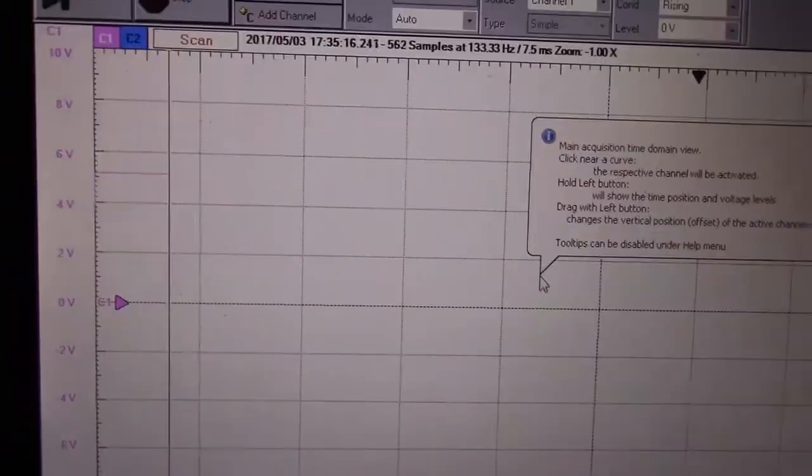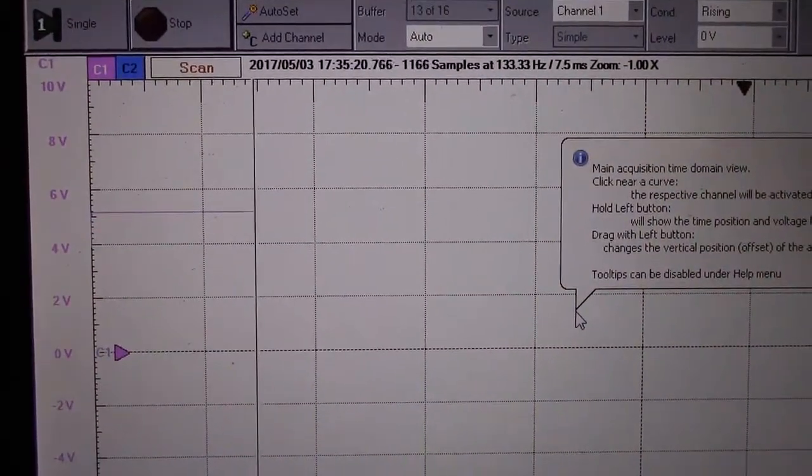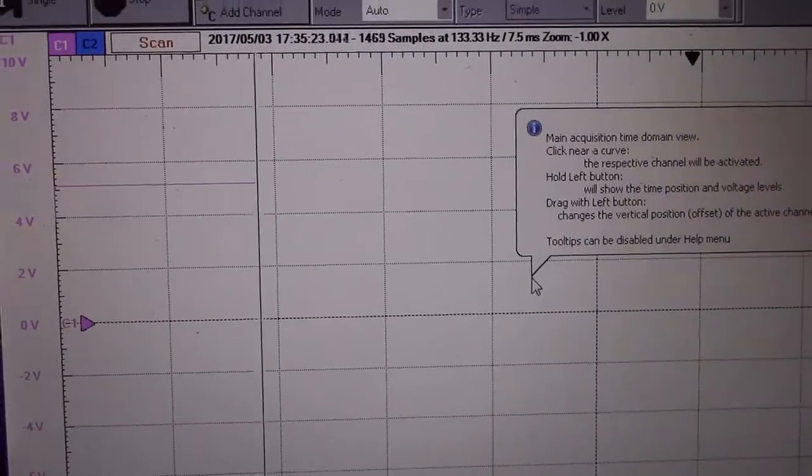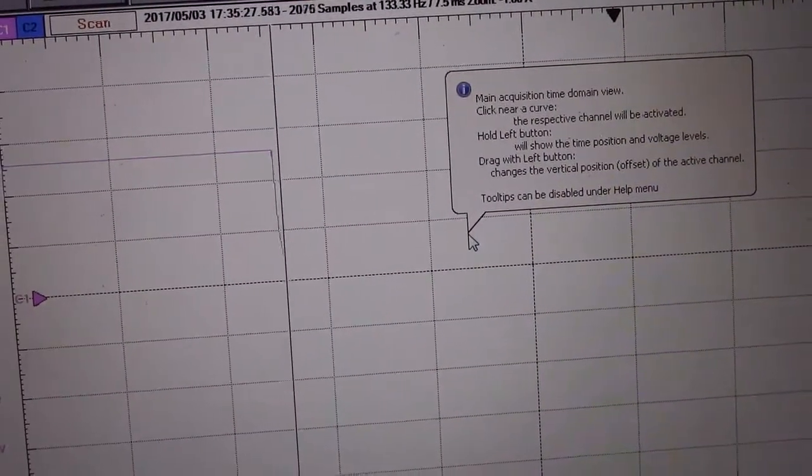Alright, I'm going to switch the bleeder resistor on. There's not going to be any change in the output because it can handle the wattage. So it's just burning off the extra wattage in the resistor right now, which is what that equation was. Now I unplug it. Bam!